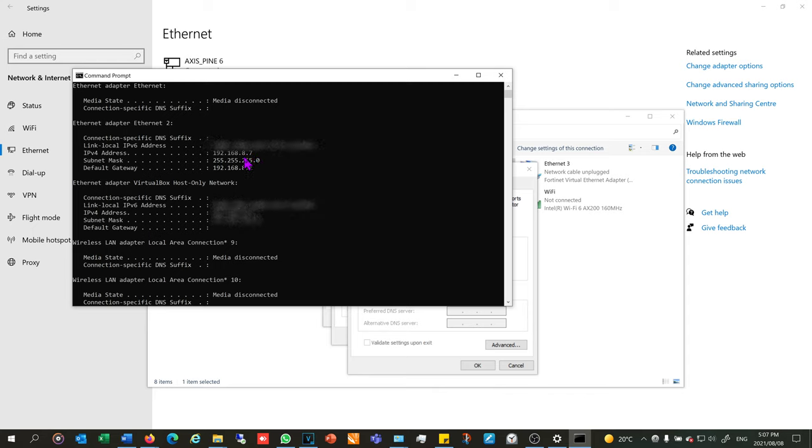The default IP address of the camera is 192.168.1.108, so immediately there's a problem — I'm on the 8 network and the camera is on the 1 network. I need to change my IP address in order to actually view that camera. I'm going to hop off this network and change my IP address just for a short time. Also note the default gateway, which is 192.168.8.1 — that's the address allowing my computer to access the internet, and I'll be using it again a little later.